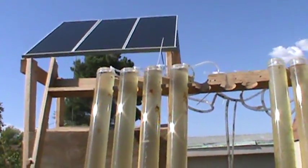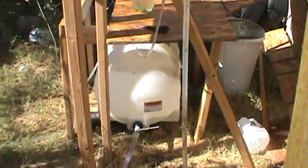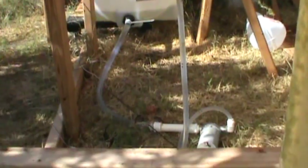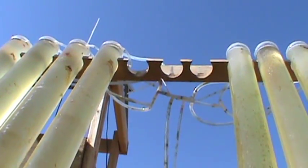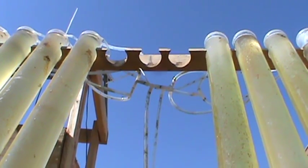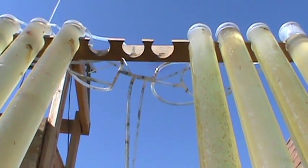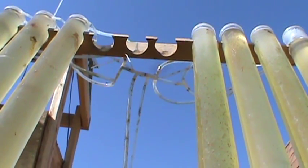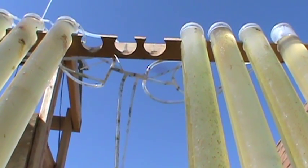As you can see up here, I have a water tank — it's 35 gallons — and that 35 gallons is fed to this water pump here which pumps the water all the way up to the top. The tube to the right is a return because as these tubes are filling there's air inside, and that air gets compressed so it needs a relief, and that second set of tubing serves as that relief. Of course since the tubes top out, the excess water goes through that tube as well.